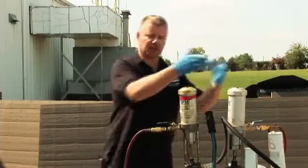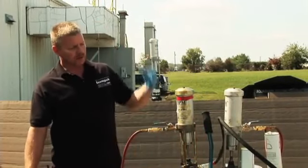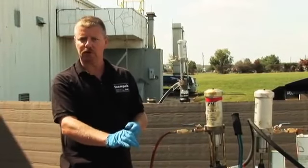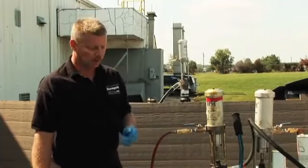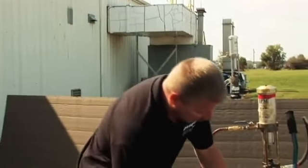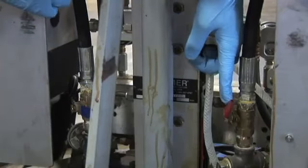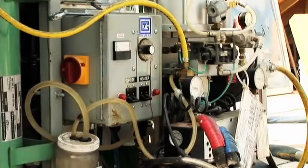Then we would go ahead to the other pump and do the same exact procedure. From the transfer pump, we're going to go and clean our screens. This happens to be the older type machine — the screen's in a little bit different position. When we go to clean our screen, the first thing we want to do is shut off the supply valve right here, and make sure that valve is shut off.